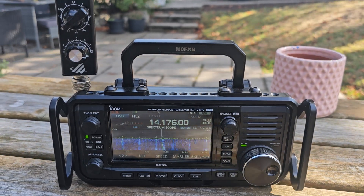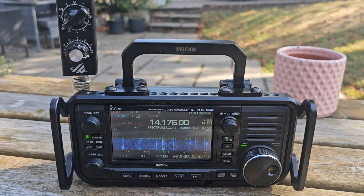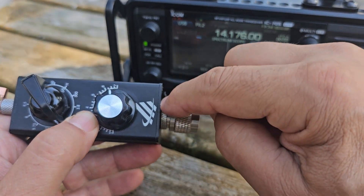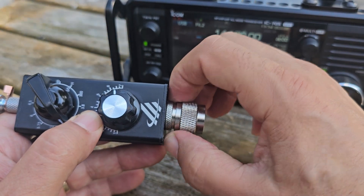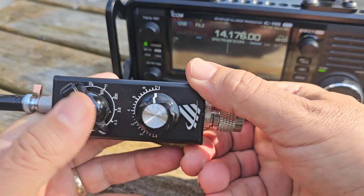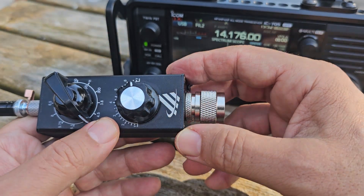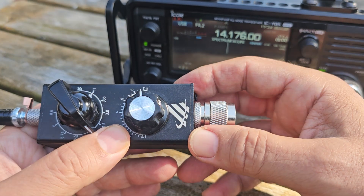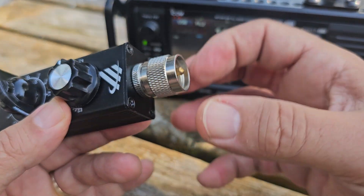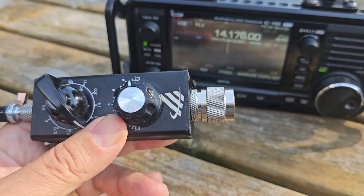What I'll do to end this section is put on my long wire. Be very careful not to twist the base of this — if you do, it will snap off the wire that connects into the capacitor, the variable capacitor. Then you'll have to take the screws off and solder it back on — it's very doable, but worth avoiding.